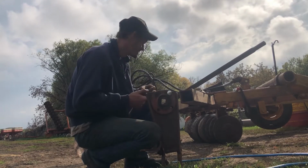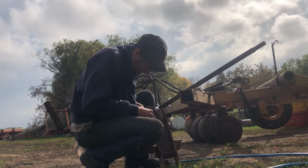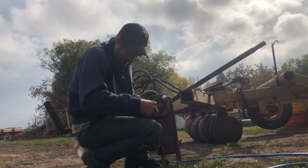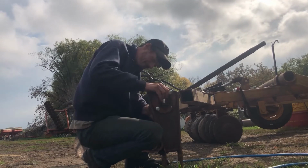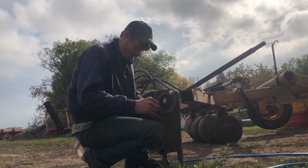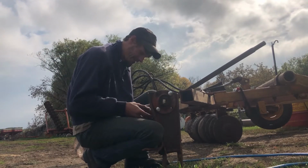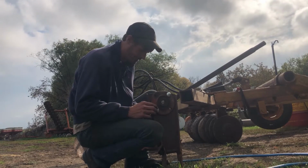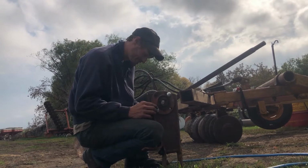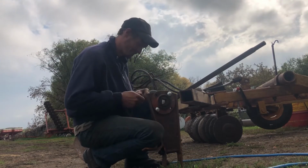And when I revisit this, I think I'm gonna have to do some welding on these hangers. I mean, they're gonna work for what I want today, but they are not pristine. I think they need about 3/4 of an inch of, looks like, quarter plate welded to them. There's another one.